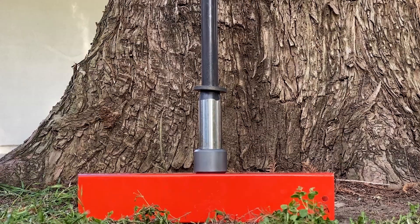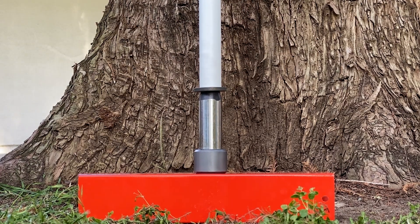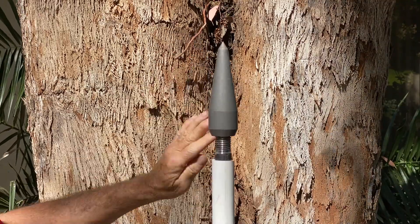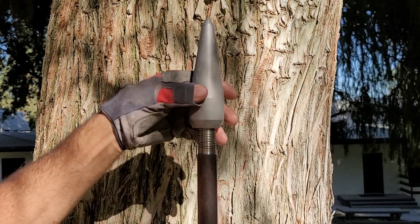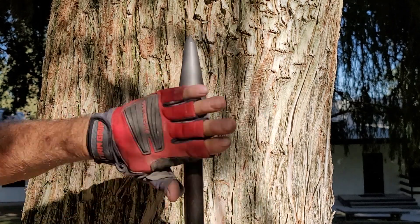The pipe should be resting on the washer which seats against the enlarged end of the shaft. If the washer is not there for support, the pipe will crack as it is driven through the ground. Next, put the point back on the shaft. For the standard installation process, remove the compression point and the washer and replace the compression point onto the shaft.